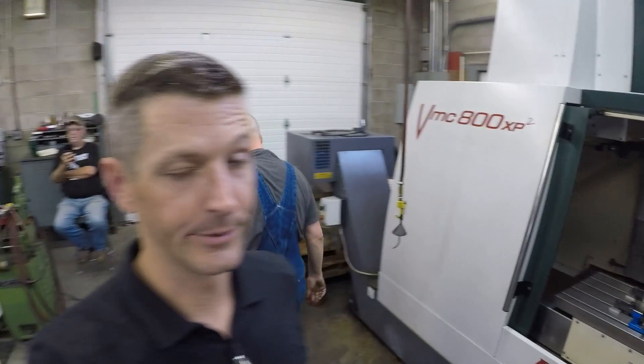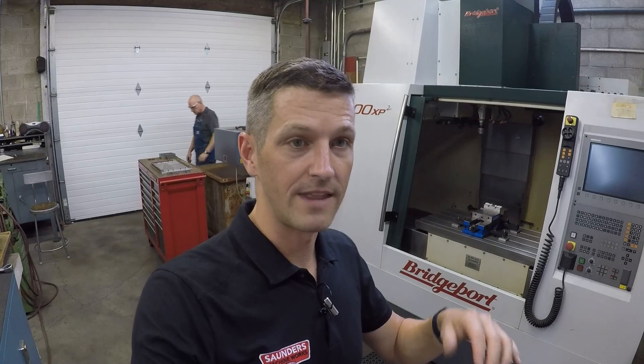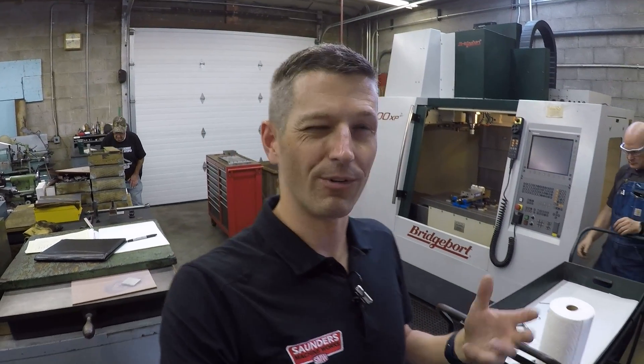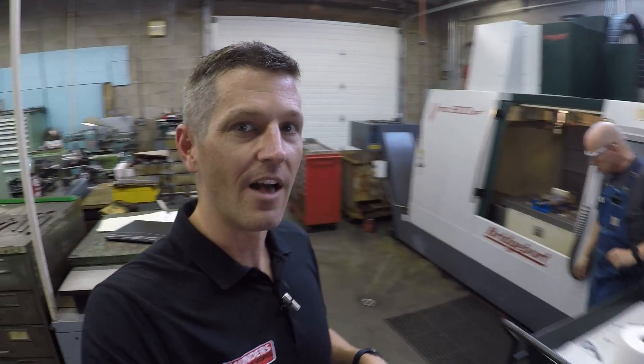While Paul's getting the machine turned on — another businessy tip: when buying material for a job like this, the way vendors will quote stuff — whether it's a material supplier or grinding supplier — consider buying the piece as strips. Instead of 400 individual pieces, buy 100 four-inch strips or 40 ten-inch strips. You'll often find the double-disc grinding or Blanchard fee, saw cutting, all come out better, and as long as your fixture can cut four at a time out of one strip, it's a win all around.